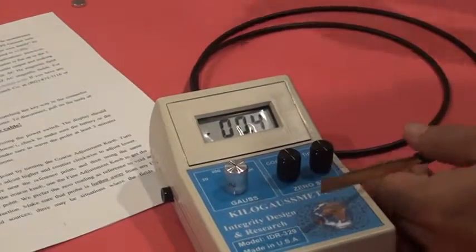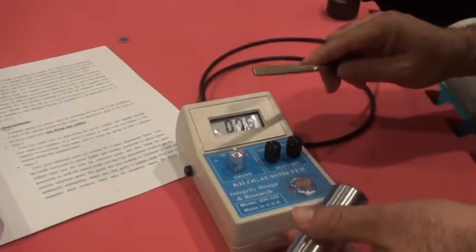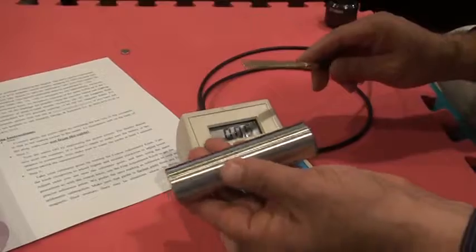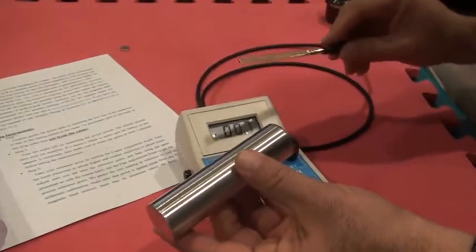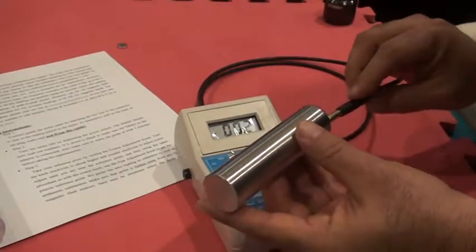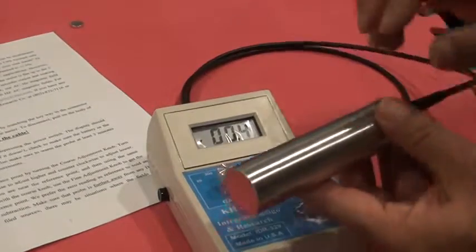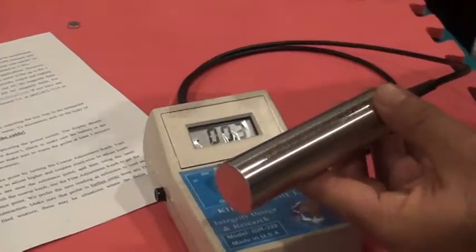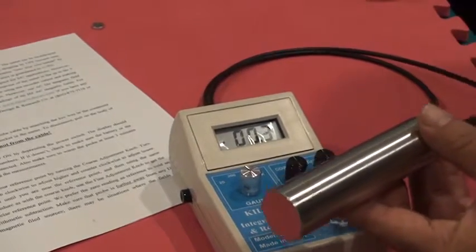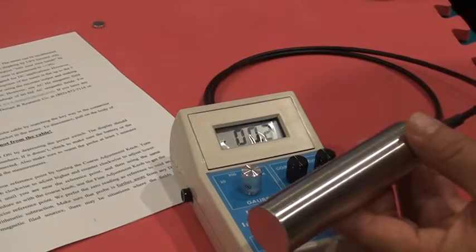Also, it is recommended, if you are in an area like MRI where there is a magnetic field and there is no way you could zero the meter, to use a zero Gauss chamber. You insert the probe inside the zero Gauss chamber for tuning or zeroing your meter. The zero Gauss chamber will shield almost all the magnetic field from outside. This is a particular application, especially if you're doing it inside the hospital for MRI measurement.